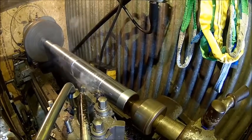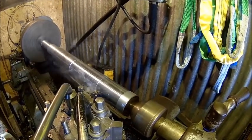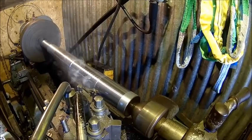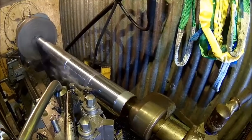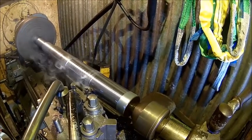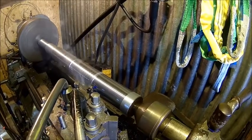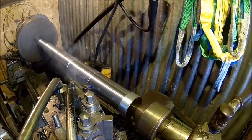It's doing alright. I can probably do about one and a half millimeters depth of cut, and then we're running out of horsepower on the machine because that material is tough — but the finish looks really nice. Not unhappy for the price. We'll see how it lasts, but the good thing on the WNMG is we've got six cutting edges.